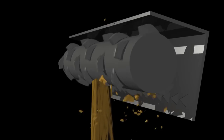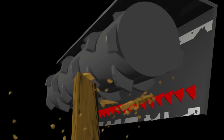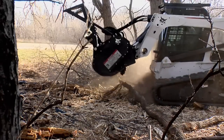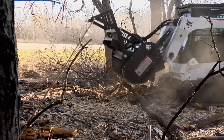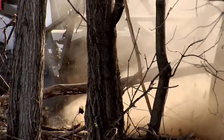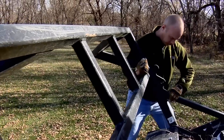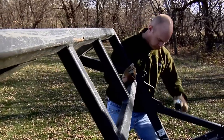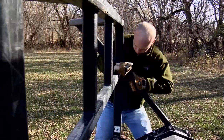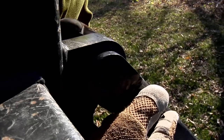As the rotor cuts up into the rear of the bulkhead, the counter cutting rake tines work with the cutting tools to reduce and shred material. They're thick and aggressive, and you can add an optional debris door to contain material within the cutting area. The adjustable three position push bar helps you adjust performance in thick, heavy brush or standing trees. The tubular frame steers material into the mulcher, reducing the potential for trees to fall outside of the cutting path.